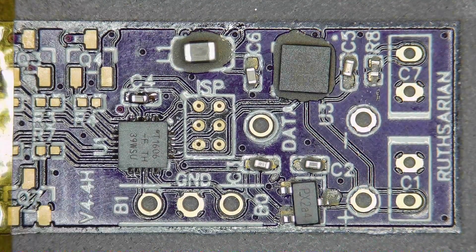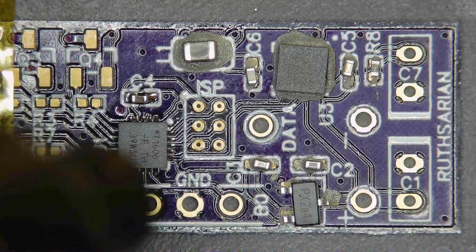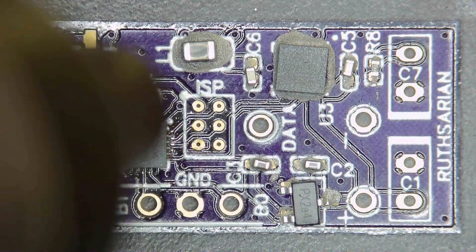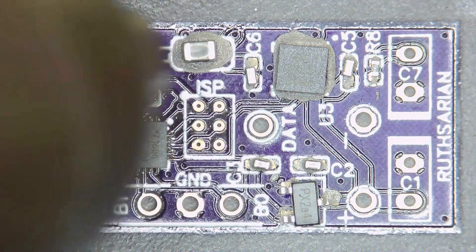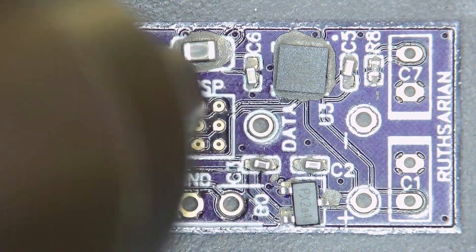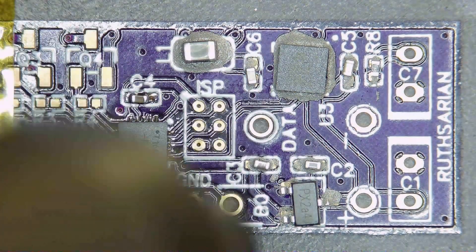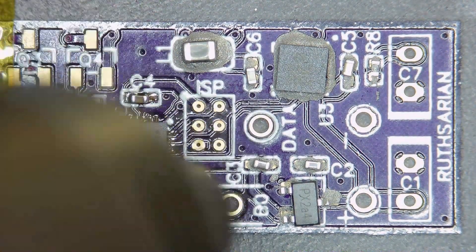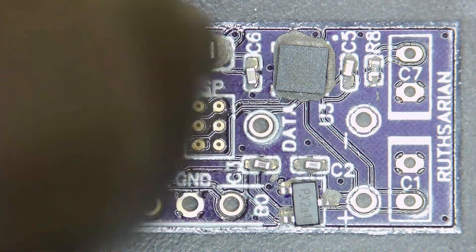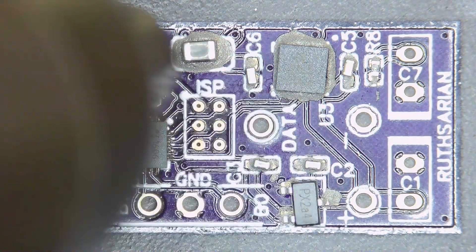You can see some of that shine starting to go away. I'm going to start to bump up the speed a little bit — up to a 5. Bumping it up a little bit more because I don't see the components dancing, which means they're fairly well stuck to the board and should survive a little faster air. Remember the faster the air, the more heat you're putting on the board, so the faster everything will come up to temperature.